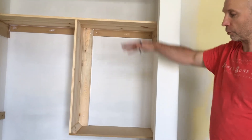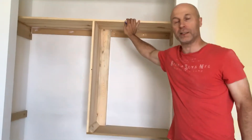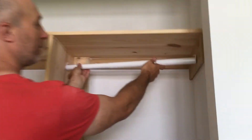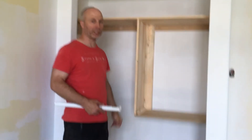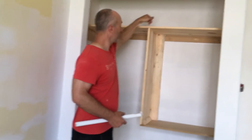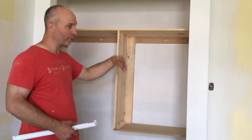At this point all the drywall has been primed, but before putting away the primer I wanted to finish off the inside because I'm going to develop a custom shelf in it. I want to put a rack in here for clothes, then another one over here and one lower down here, because this is for my younger daughter. The bottom space has shelving planned. I used a two by four here because it wasn't going to go all the way down to the floor — I had to secure it well to a stud on the other side of the wall. Now you can pretty well stand in this thing and it's not going to sag over the years.